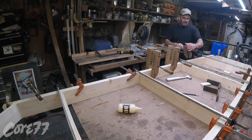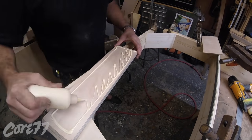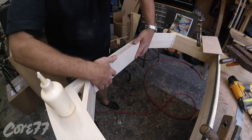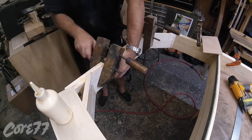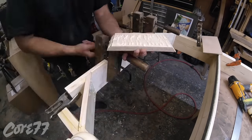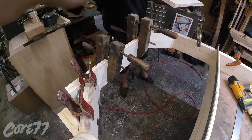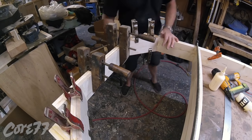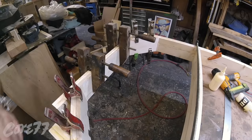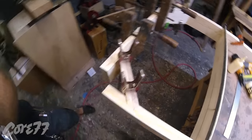Now most importantly, where the bolts are going to hold the legs on, I decided to use Baltic birch. I've cut a few pieces of Baltic birch just to secure the whole end, because those bolts need to have a good base — just going into that knotty pine certainly isn't going to be strong enough. So with a layer of knotty pine just to give it some girth, and then the Baltic birch plywood — which is a multi-layer plywood with no voids in it, 11 plies — glued and dried, it's going to give it a tremendous amount of strength.